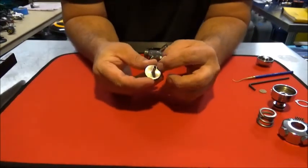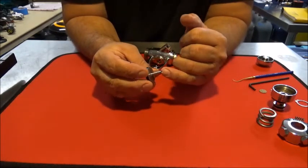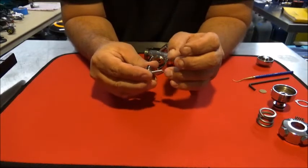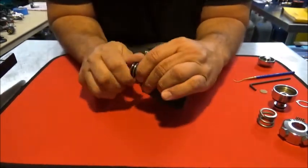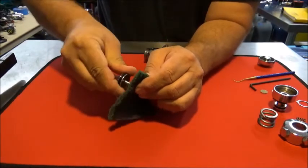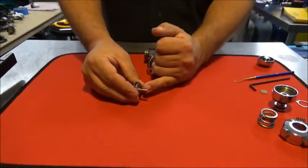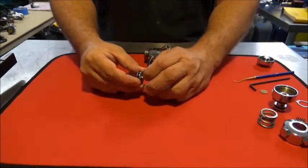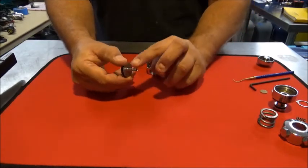Now on the piston - remember this one had a lot of corrosion and a little rust - got it cleaned up. You don't want to ever do anything aggressive to the seating edge. Take your fingernail, run it around there, see if you can detect any burrs or dings. I take a 3M pad, which is really not aggressive on stainless, and simply just twist it back and forth a few times, then holding my finger on the outside, push the seat edge against it - just cleans it up. Now a lot of your movement on your piston is going to be in this area, so we are going to put a little lube on there - less is more, we're not packing wheel bearings here.